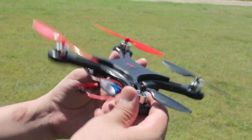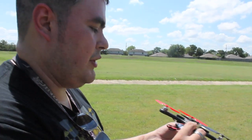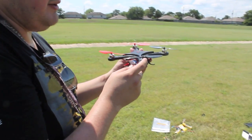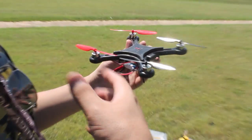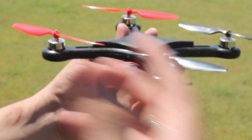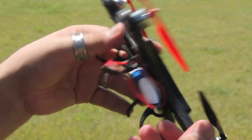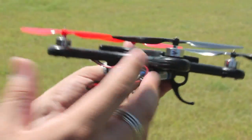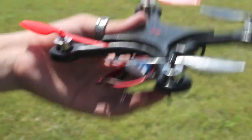When I first designed this, I take what I want to make, figure out what it's going to weigh, find a motor, check the specs to find out how much thrust I'll get per motor, multiply that by four, and make sure I have at least a 2-to-1 thrust-to-weight ratio. That's pretty much what I did with this — and this was the first thing I ever 3D printed and designed. Weight-wise, we're looking at less than 200 grams.